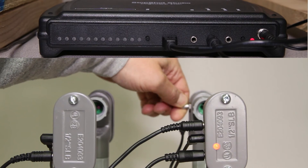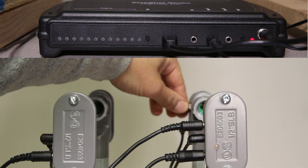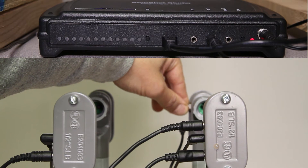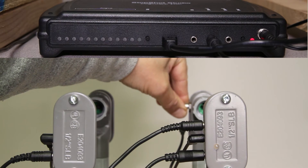Now what we're going to do is turn down the power all the way — you'll see the light go out. Then we're going to slowly turn up the transmit power just until that light changes color. The reason we're doing that is it'll maximize the sensitivity. If it's turned up too high, it'll blow right past the pellet and it won't detect it. Your finger will break the beam, but something small like a pellet won't. So we're going to turn this up slowly, very slowly, just until we see the light change colors.